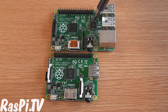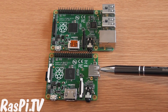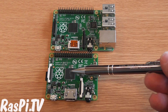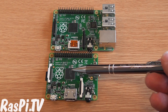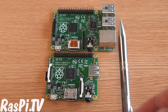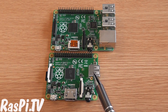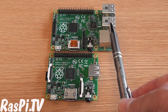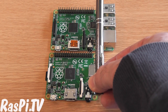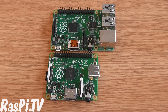So you've got no network chip because you don't need it, because you've just got the single USB port, which is run by the onboard USB handler on the BCM2835. Without that network chip, you don't need a network port, and you can only have one USB. Effectively it's like the B Plus with that end cut off, but everything else is exactly the same, as far as I know.